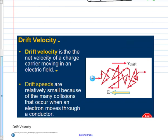So we have a current. This is my switch over here on the wall, and we have a current that has to get information from this switch up to those lights for them to come on. It's probably a few meters to get there, right? Now, in the wire, electrons are the things that are doing the moving. That signal gets there almost instantly, but the electrons are not moving from that switch up to the light instantly.